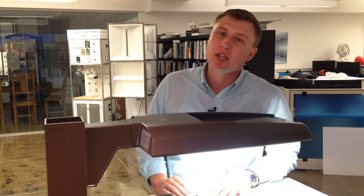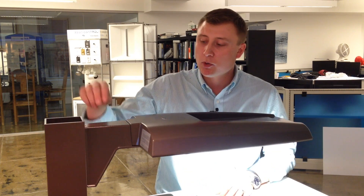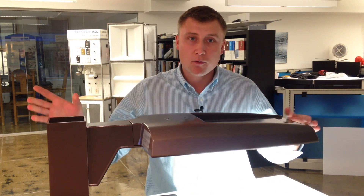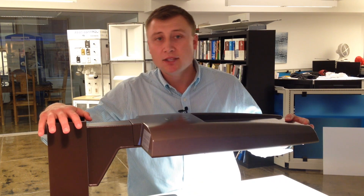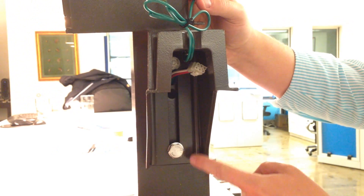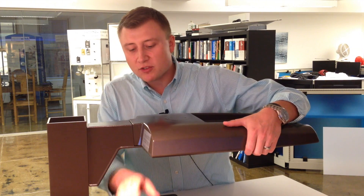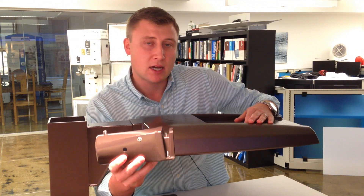What's standard and very unique to this product is a quick mount arm. Whether you're talking about a mast arm for roadway applications, a wall mount version, or a quick retrofit on a round, tapered, or square pole — that's what we have here. This arm mounts directly to a four inch square pole and allows us to not worry about pre-drilled bolt patterns, and eases slipping this product onto the unique patent design technologies.